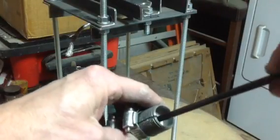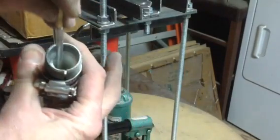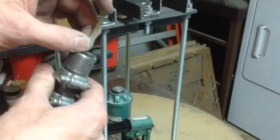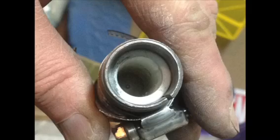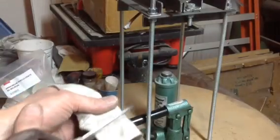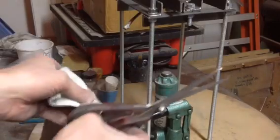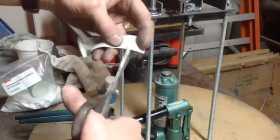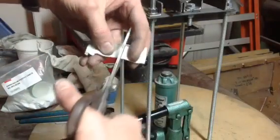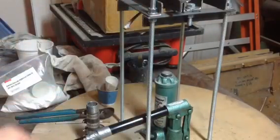Sometimes it's a bit of a chore to get the thing back off. Now I'll clean out the inside. After I've added my second amount of fire clay mixture - about 8 grams total in this case - I use this gauge to see how far the little pintle sticks up. You can see in the close-up that's going to be the initial cavity for the powder to combust from - about an eighth inch. Now I'll cut one-inch squares from a cotton cloth. The next die on top is actually a flat piece, and I'm compressing in the propellant powder dry - no moisture added. It's not a corning process with three or four percent water. I'm relying on tremendous hydraulic pressure to consolidate.